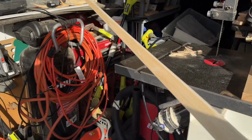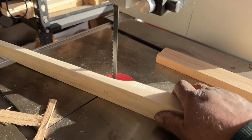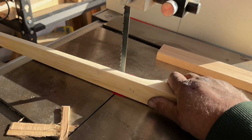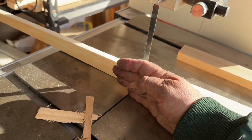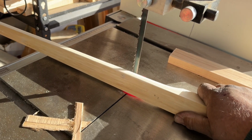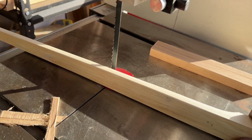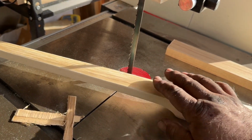Okay, what I want to talk about on the bandsaw is that when I lay it out on the bandsaw, and you're trimming, a slight turn either way, and you can make this a kitty bow. So when you're cutting, I try to have the back of the bow parallel with the table. If anything, I'd rather have it torqued up when I'm pulling it through, and that will leave the bottom side a little thicker. I'd rather cut it through and have it a little thicker than go, oops, this way, and when you look over here, there's nothing left, all right?